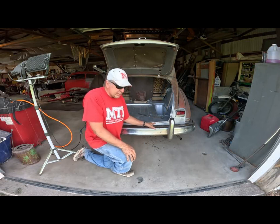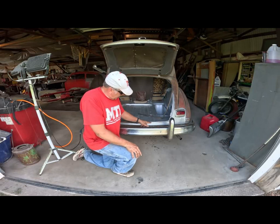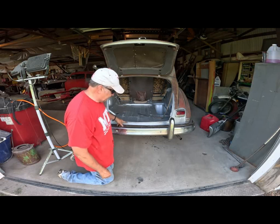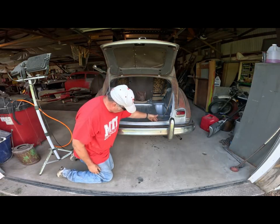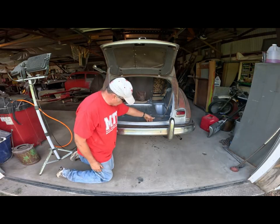What I ended up doing was I used a plasma cutter and cut a nine-sixteenths-wide piece of 18-gauge steel. I bought a big four-by-eight sheet of 18-gauge steel — I think it was like 85, 90 bucks. Cut one out and welded from here all the way to this other side. That was my first edge — the horizontal edge. And then I had to do the same thing with this back vertical edge — weld all this, and I welded that on the backside. It didn't project as far to the back, so I was able to catch this first edge a little bit and weld it on the backside.